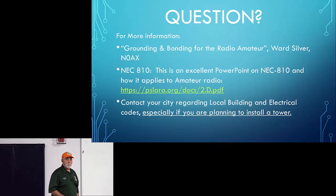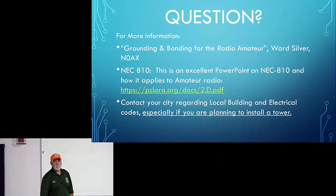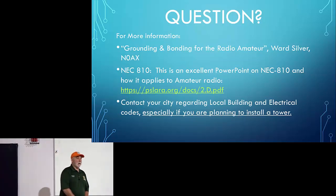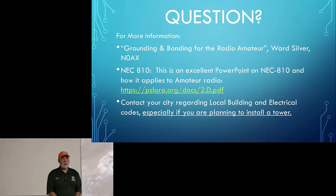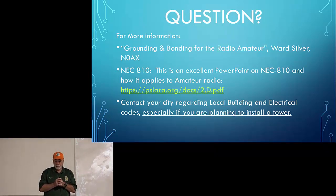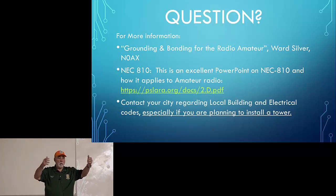Go ahead, Gil. Yeah, I just wanted to go back to Kent's question on what is an UNUN. And it seems to me that chokes, UNUNs, and baluns are often used interchangeably in literature. That's done incorrectly. That's where I think some of the confusion is, the terms are used interchangeably. That's all I'm trying to point out. And there's a really easy way to tell them apart. Usually a balun and an UNUN will have an SO239. And then it'll have some sort of a lug or lugs to connect an antenna to. That's going to be either an UNUN or a balun.